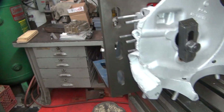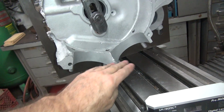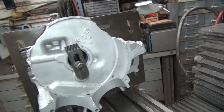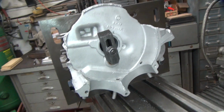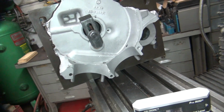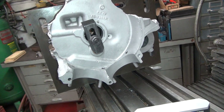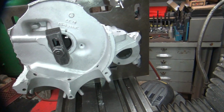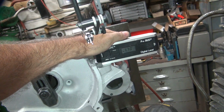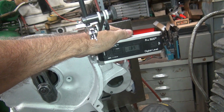Okay, so going by this surface here is 90 degrees to your center on your decks, but not the motor mount at this point. Looks like we're running about a 2-degree offset in the motor. That'd be my guess. And right now we are low on the front, which tilts the motor forward. I'm guessing that's the direction. Let's see, I know it's angled in the front.